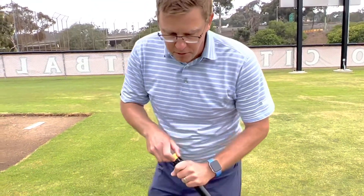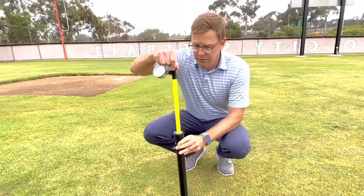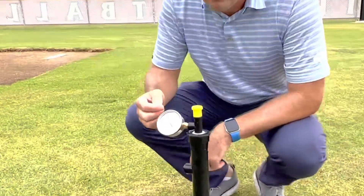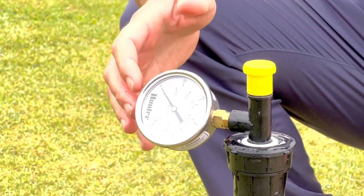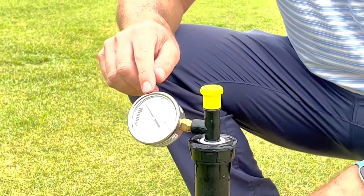So the first thing we did was come up with the eco indicator. This is a six-inch eco indicator pop-up. I also want to introduce you to the new 12-inch eco ID 12 indicator pop-up. One of the things you'll see is with this particular gauge, when the system is not running at full pressure — in other words below the minimum of 20 to 30 psi for drip irrigation — the pop-up doesn't pop up all the way.